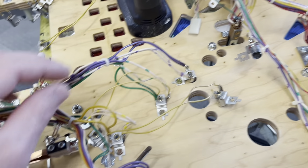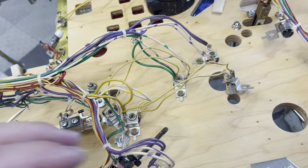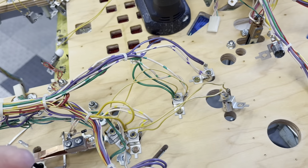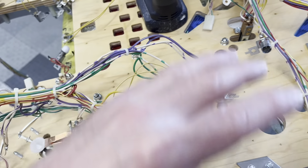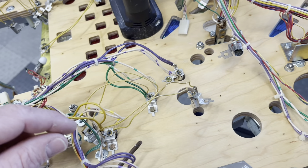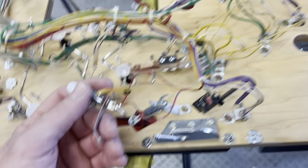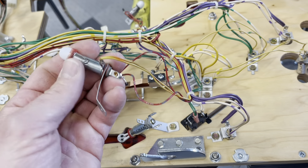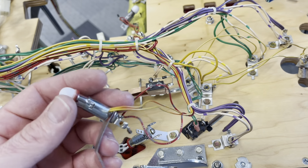The reason that's so confusing, especially on one of these, is when you start getting all these lamp sockets really close to one another, it can be hard to tell what's what and what's where. If you're blowing fuses - is it the green strand that's blowing? Is it this socket or that socket? It gets really jumbled together when you can't look at each socket and say, yes, that is on the green strand, or no, this is on the yellow strand. You can't tell. Another thing you run into, particularly with these angled sockets, is they're no good - this one right here just spins very freely, and usually when they spin freely like that, they don't work reliably.